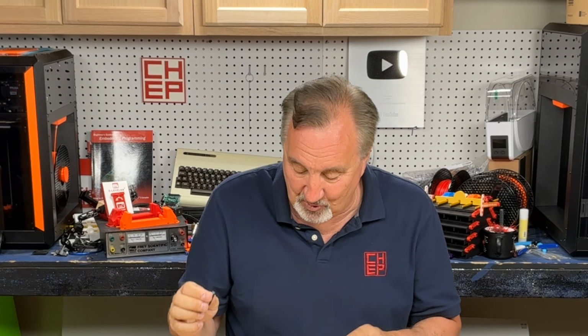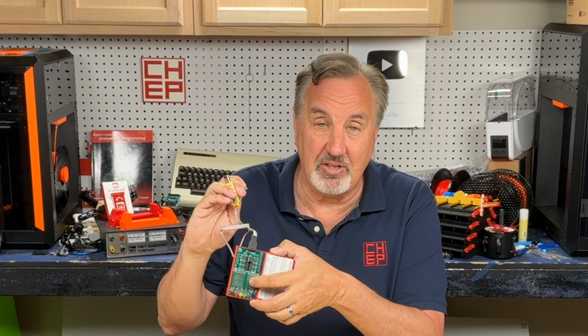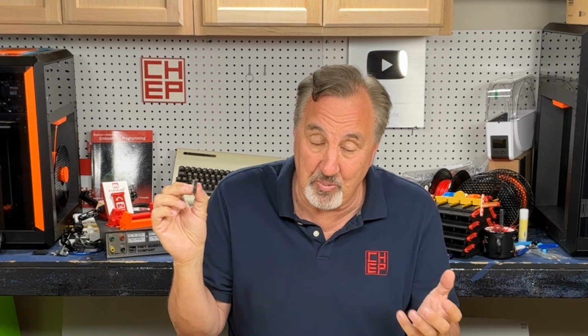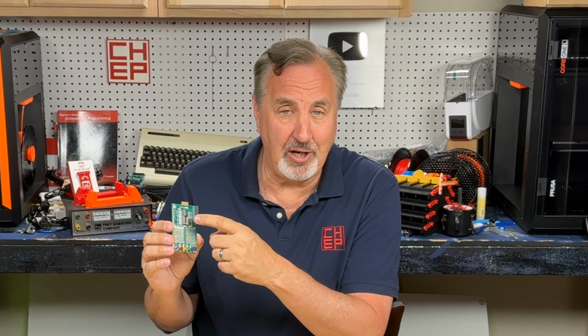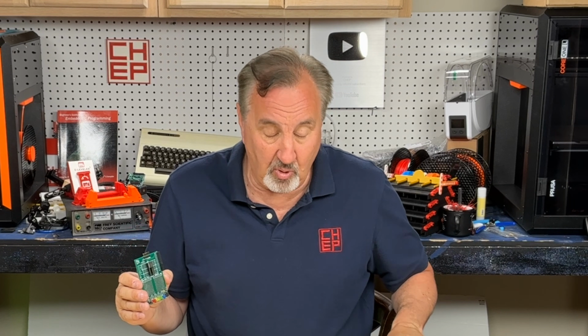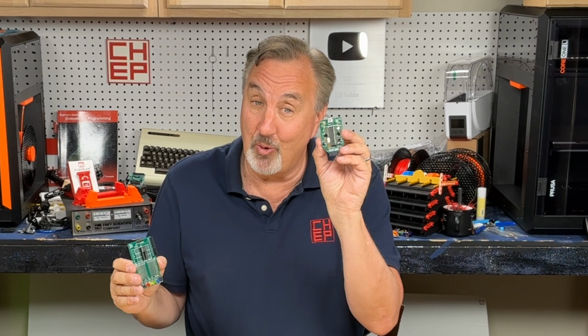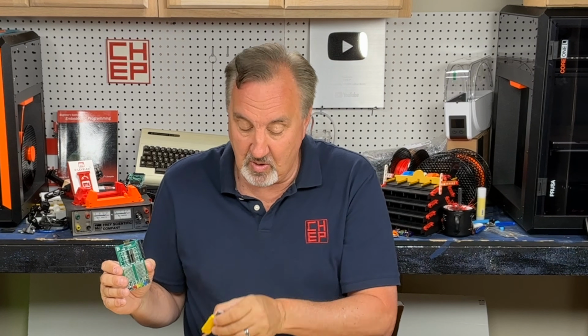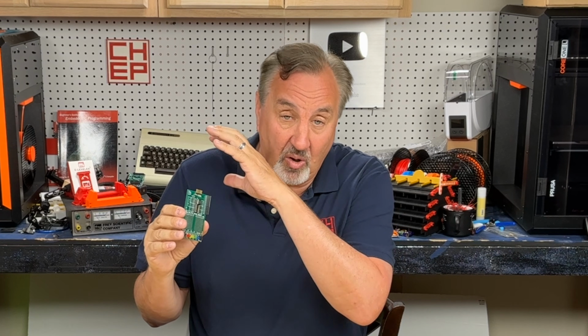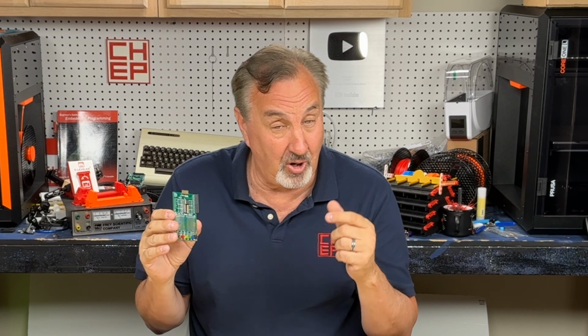So this is where open source allowed the PICkit2 starter kit to continue. You can use the latest devices and program them with updated, latest software with the PICkit2 Plus. Open source allowed all that to happen. And it wasn't just the 20-pin devices, the 8, 14, 28, 40-pin, there's a whole bunch of new ones that you can now get much cheaper than the originals and still program with your original PICkit2, your own PICkit2, a clone PICkit2, without having to buy a new programmer. All because open source allowed you to access all that with new software called PICkit Plus.